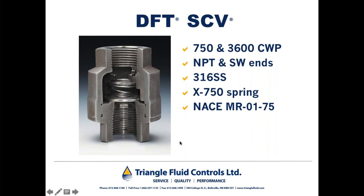Next, another small bore check valve is the DFT SCV, and this is a great illustration of a body-guided disc. So in other words, as I've mentioned before, the outside diameter of this valve is guided by the inside diameter of the body. This valve is available in pressure class 750 through 3600 CWP, or cold working pressure, equivalent to PSI, but downrated for temperature. It's available in threaded or socket welded ends.